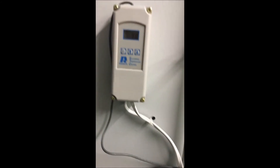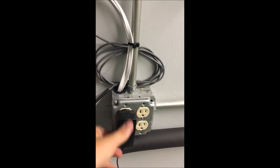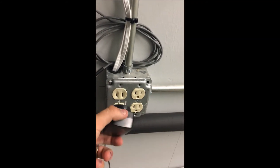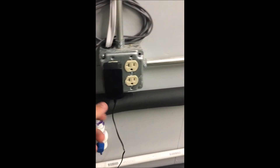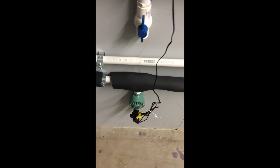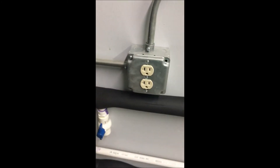So what I have here is a controller, and I have it wired into this outlet right here. This is a 24-volt transformer, because I actually bought those solenoid valves and didn't even realize they were 24-volt. Luckily, we had some in stock. So this just controls this outlet here — I plug that in, and it turns that on and off, so we can control our flow when we need it. I got that one wired up, but I actually ran out of stuff. I've got to take this one apart and wire that in for our other fermenter.